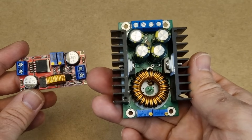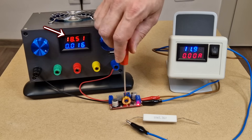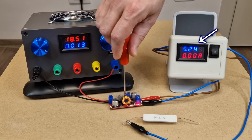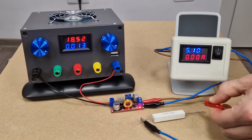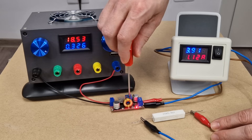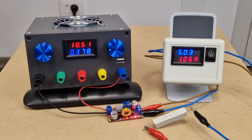Controlling the temperature inside the UPS is very important — heat means danger. In this project I will insist on low temperature, passive cooling, and active cooling. Let's set up the 5V converter. My DIY variable power supply represents the 18.5V charger, and the output of the converter will be measured with this simple volt-ammeter. I will adjust the voltage potentiometer until the output reaches 5.1V — 0.1V extra because there will also be power losses. I will connect a low-value ceramic resistor to the output as a bigger load, and turn the potentiometer until the current drops to 1A. With a 1A load, the output voltage drops by just a few millivolts and we have a stable output of 5W.